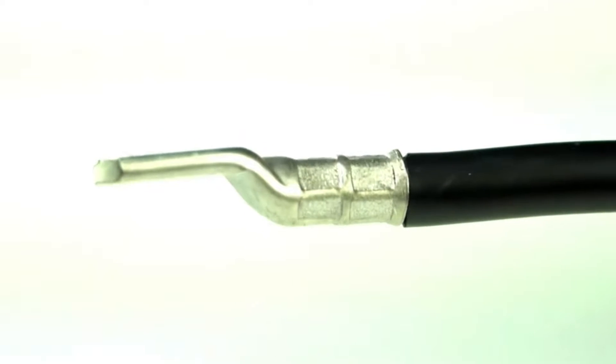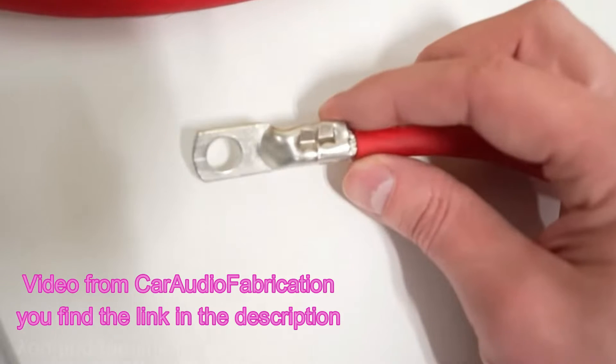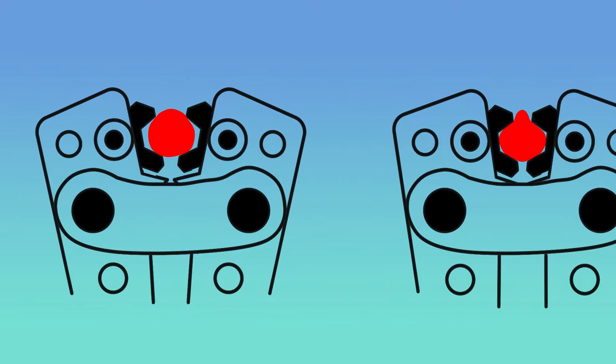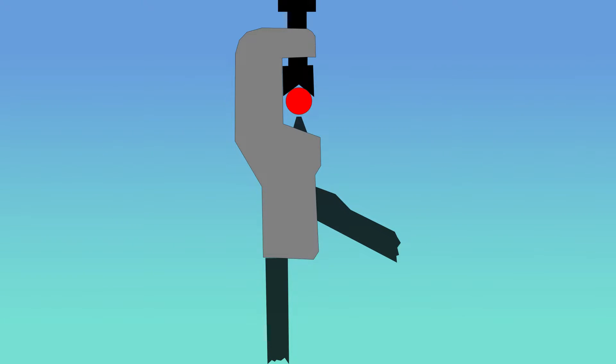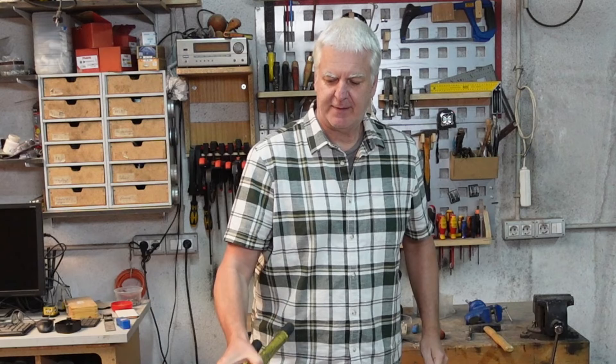Using the wrong size, you might get a bad crimp. Car Audio Fabrication has a good theory why this happens: one part of the plier closes before the other, pushing the lug slightly out of the die. Something like this can't happen with other pliers that work differently.